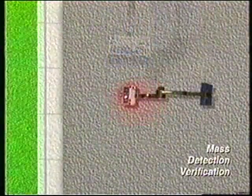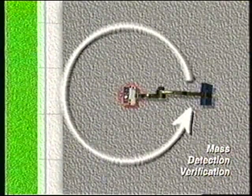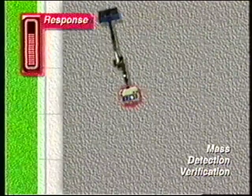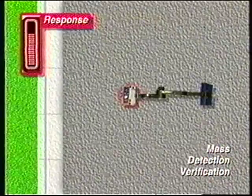To verify that the Subscanner has indeed found a mass of metal, rotate the system around the receiver in a full circle. If the response of the receiver remains constant, you have almost certainly found a buried mass of metal.